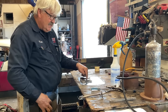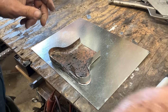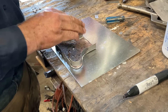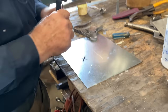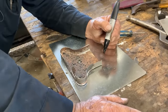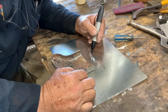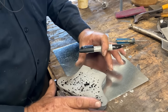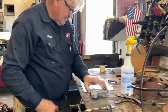This is the inside of the letter. Once we're laying this out we understand the project better than any other time in the process because we've already done some of the thinking. Since this is the inside, we're going to mark it as the inside. Up here on the top, since we can't solder to the sign - we don't want to add any acid to the sign that would continue to corrode - we're going to add a quarter of an inch so when we get ready to put the new one on we can slide it under the existing letter.